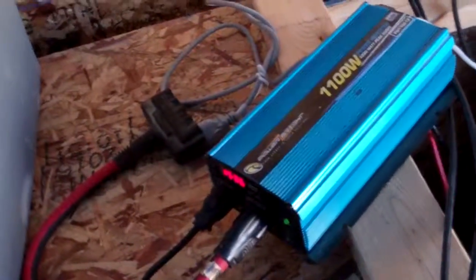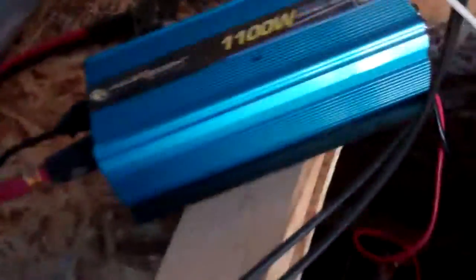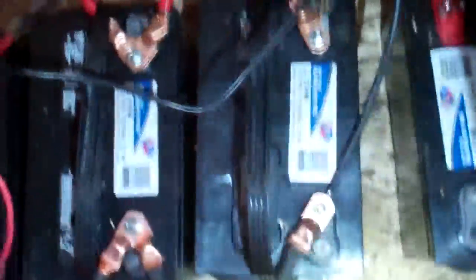This is my test environment and my review so I can look back and see what I've done. I need to watch out for battery gases — I'm going to leave this open. I'm not supposed to have my inverter or controller next to my batteries because battery gases are flammable. I need to figure out a way to vent these batteries.